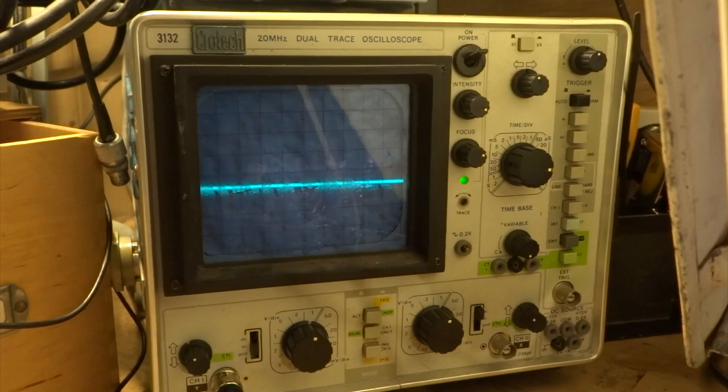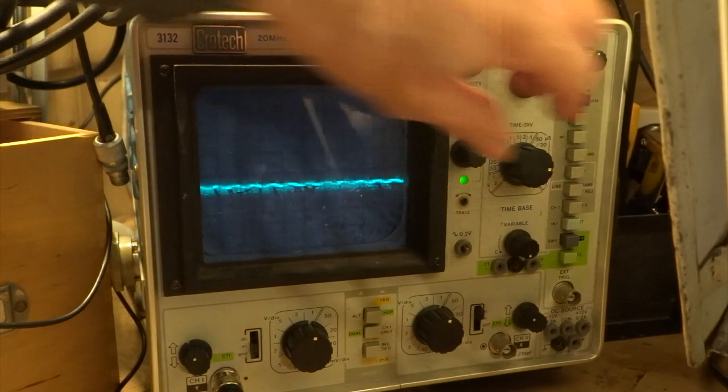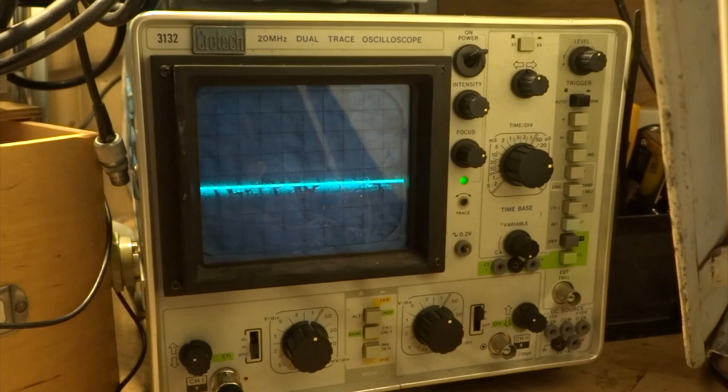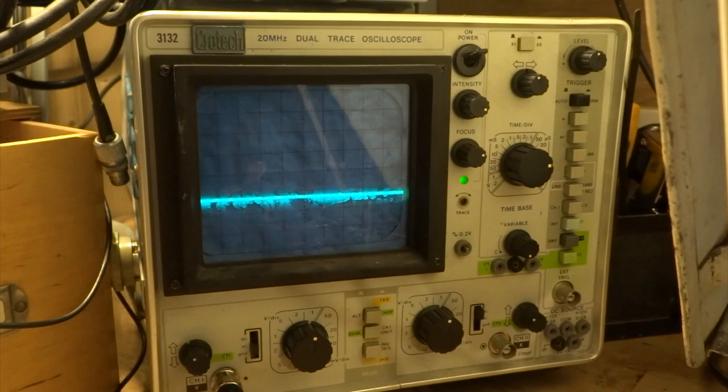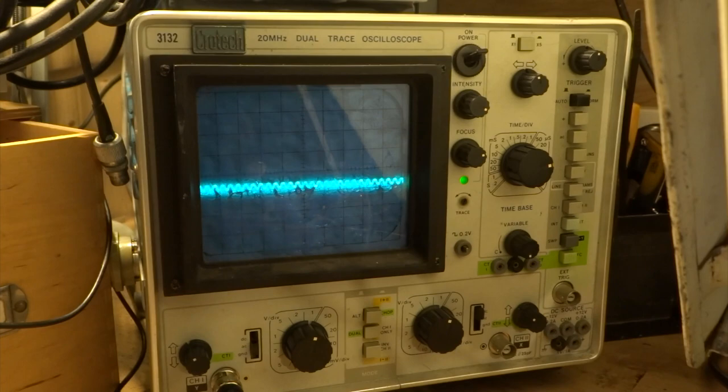Checking through the remaining pins — pins 2, 3, 4, 5, 6, 7, then pin 8 shows a little bit of a waveform. When I first started using the scope I didn't realize the probe that came with it was a times ten probe, so that skewed the readings slightly. Now I do have a times one probe so the readings make more sense. Continuing through pins 9 through 14 there is a little bit of activity, but it's not the waveforms we're looking for.